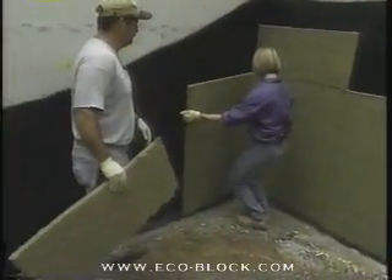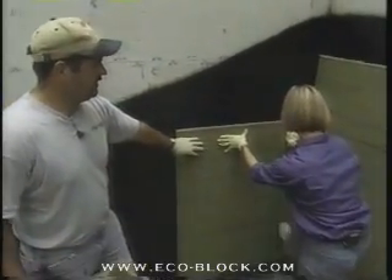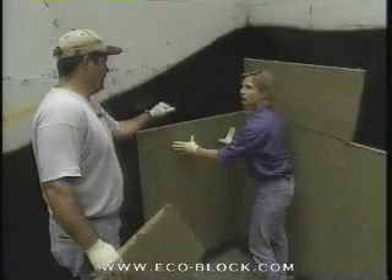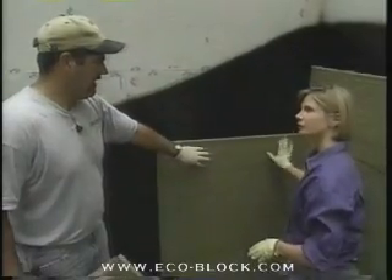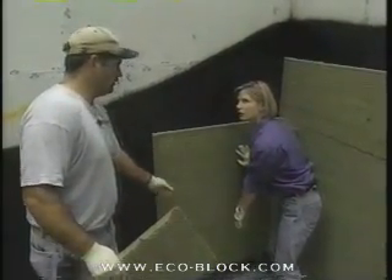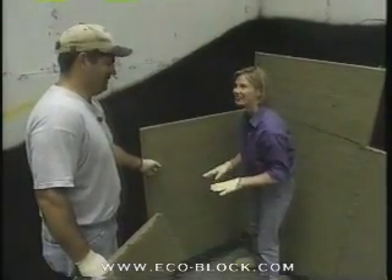Now we're going to put this aqua board into place. The aqua board is a mineral board — mineral wool. The first thing it does is protect my coatings, especially on a styrofoam foundation. It's a very rigid coating, but if a rock were to fall it would cut my material. On a concrete or block foundation I don't need to protect it. This adds water drainage — any water caught in the substrate, in the soil, drains through the soil, hits the board, runs down to your exterior drain tile. So you have a drain tile down here and it takes all the water away from the house — yes, and that is crucial.